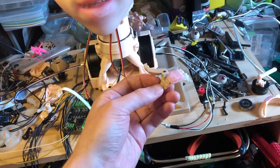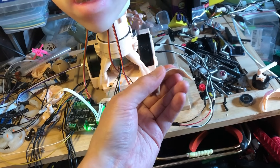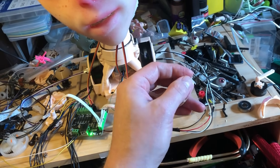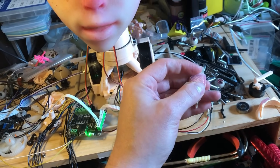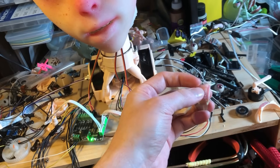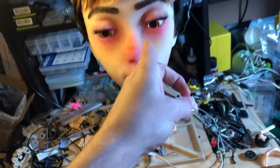So this is the upper eyelid part. The idea here is I've got a piece of velcro that I've super glued to the top and all the loops are sticking up this way. And onto that I've cast a bunch of silicone. I've just tested this one out to see how well this would work, and it's working pretty well. Silicone will peel off of PLA very easily, but it's mechanically bound up in all this, so this should allow me to attach it to the eyelid.